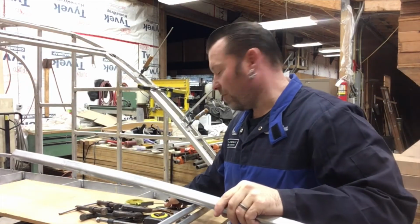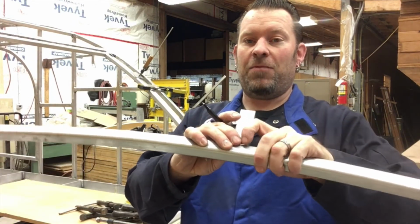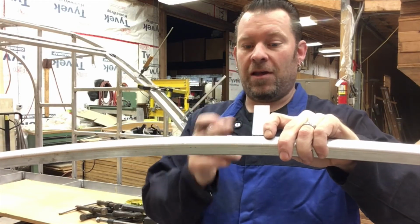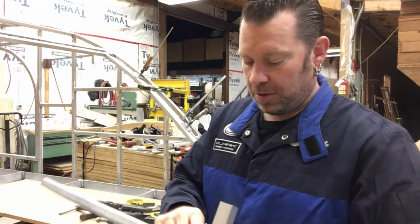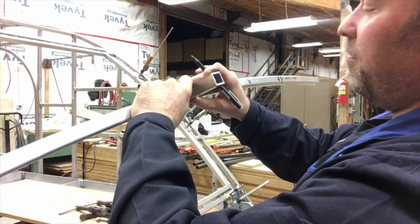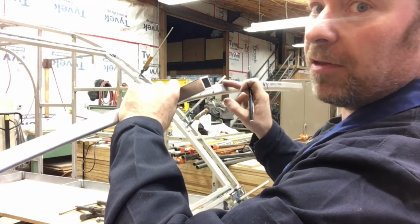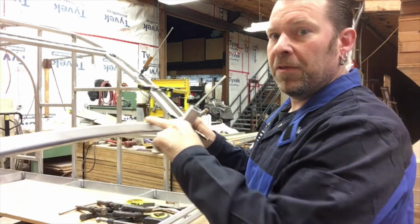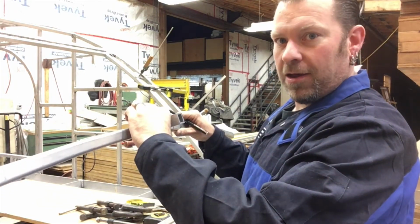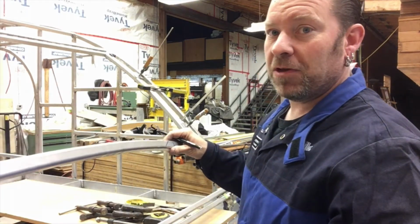So all I do for that, I'm sure the pros have some certain way, but if you take a scrap piece of pipe and fit it along the top and the bottom, then that radius is square at that point. Just take it like this, wherever your line is, and you put your finger like that, and as long as it's flat on the top and bottom, you know this edge is square to wherever that pipe is at the time, where a square won't do that because it's longer. The longer something is, and you're going off the top, not the side. This is going off the side. So that's what I do, and it seems to work for me. So just something you can do.